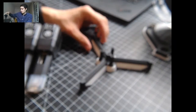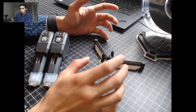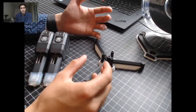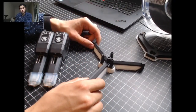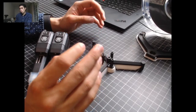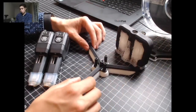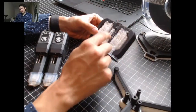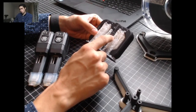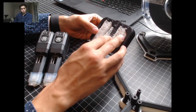And with ABS, one of the tricky things is that it's not going to want to attach to any type of support. So for example, if you're familiar with PVA, the traditional water-soluble support, that's not going to work with ABS. So you'll have to use one of two options, either a breakaway option, which would look something like this, right? So this is breakaway, but still using SR-30. I'll talk a little bit more of that in a second. But you could use breakaway supports with ABS.